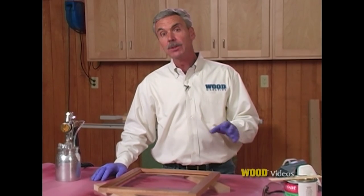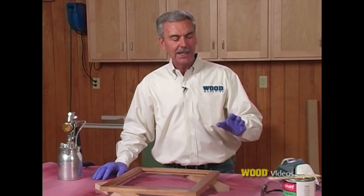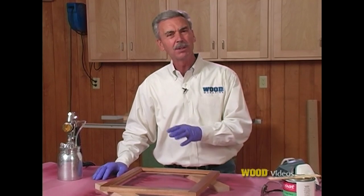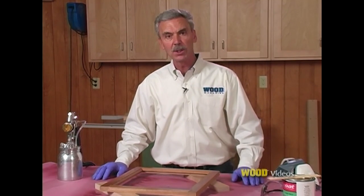It's also important to reduce flame and spark potential, especially when you're spraying flammable material. I would suggest that any time you spray something flammable, though, you do it outside your shop. If you're spraying water-based material, you can still do it inside your shop, as long as you've got a window open and, of course, you're wearing one of your respirators.